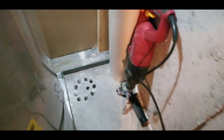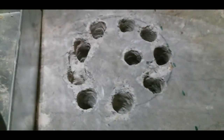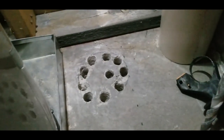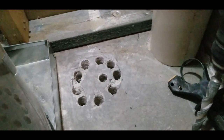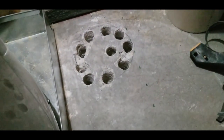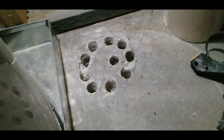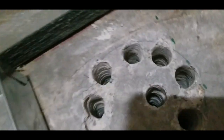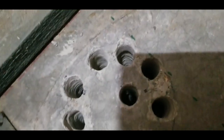You can see I drilled a series of holes just with the largest bit that I have. You can rent a core drilling bit to get a nice clean hole if you want, but this way I didn't have to rent anything. It saved me probably fifty or a hundred dollars, and the professionals in a video I watched say they like to do it this way anyway. So I drilled a series of holes around where the pipe needs to go.